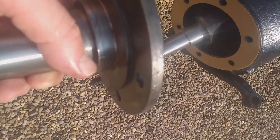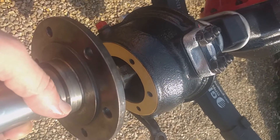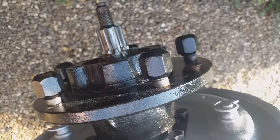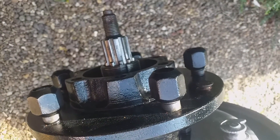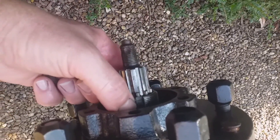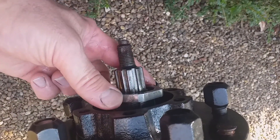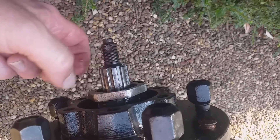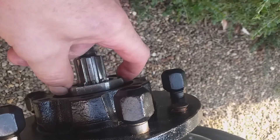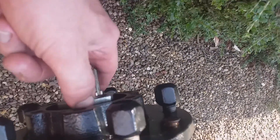At the right-hand side we've got the keyway. We want to make sure the front hub assembly is nice and oily and clean. We can see the keyway, so we'll put the first washer on in there and then put on a hub nut. It's a good idea to get my hub nut socket — the Britpart one — so I'm going to go and do that.